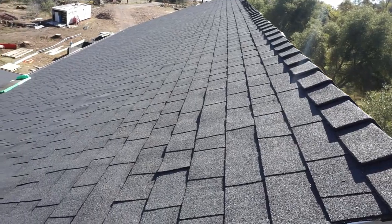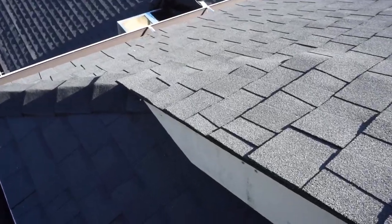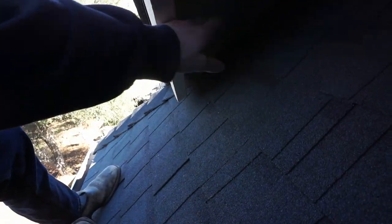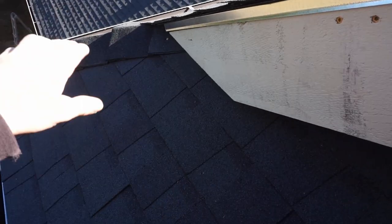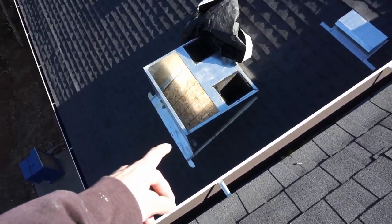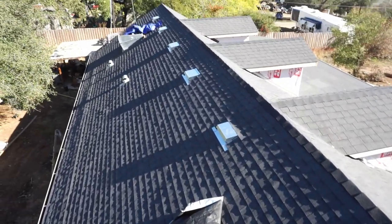It's nice to be dried in, but just feeling like the house is on its way to becoming more finished — it's great. And here's that detail on the corner I was talking about earlier, where we had to run the roof underneath the eaves and then put the eave boards back on top and then roof over everything, so there's not a pocket where water's going to seep through because of lapping issues. Right now we have everything overlapped, so it is definitely protected from the elements. And there's the curb for our dual pack, as well as one that needs to be worked on a bit so that we can have heating and air. All the vents like I showed you earlier.